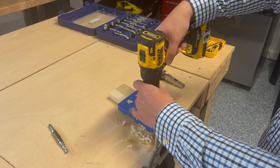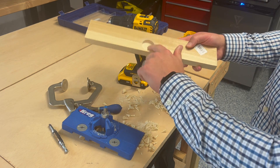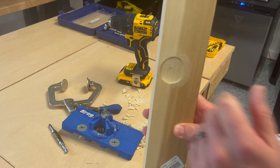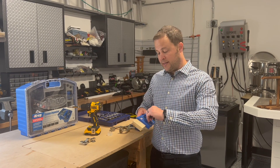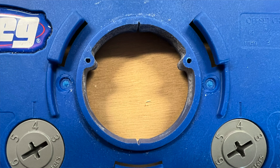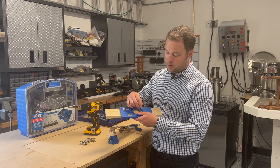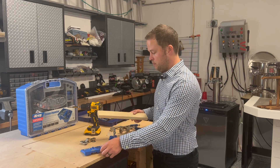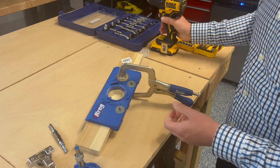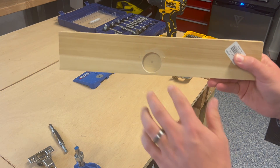And there we go. You'll see that the hole is right at the correct spot for our hinge. Once you're done drilling, leave the clamp on, take your drill bit out, and there are two little holes in this jig where you can grab a 1/16 inch drill bit and drill through just a little bit to start pilot holes for the screws that will ultimately hold in your hinge. So now when I take this off, I've got a perfect spot for the hinge and a perfect spot for the screws.